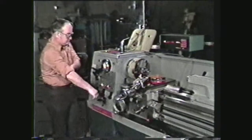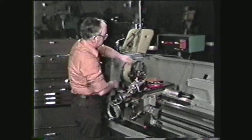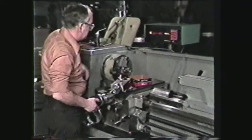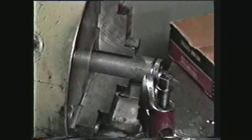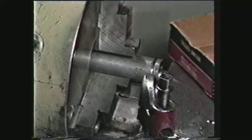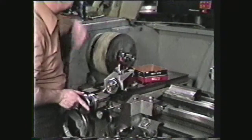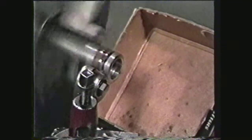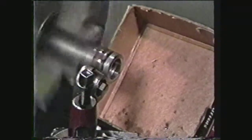Work to be parted must be held in a lathe chuck since one part of the work will be severed. The work setup should be kept rigid — this means as short an overhang in the chuck as possible. And never catch pieces being parted on the lathe with your bare hands. If you want to prevent damage to the part, catch it in a container.